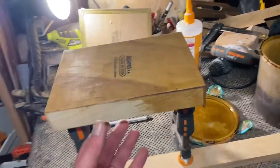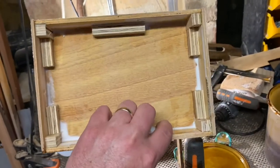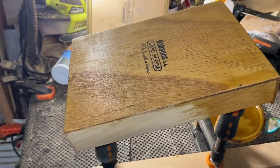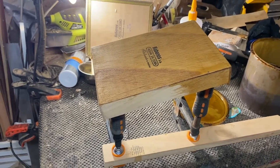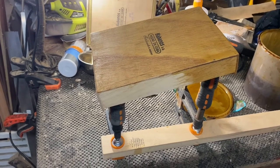This little thing — I'll just give you an idea of what I've had to do with it, because it was just falling apart. It is lined out now, as strong as any box you'll find. Just a little tip: don't be afraid to stick it on your belt sander and just sand the hell out of that paper, just get it off. It didn't hurt the box, didn't damage the box at all.